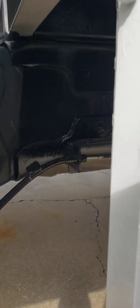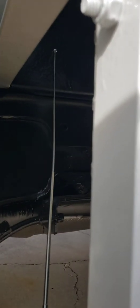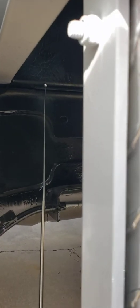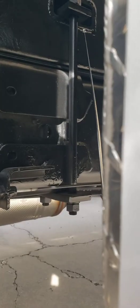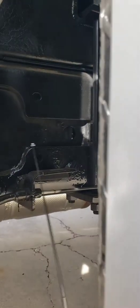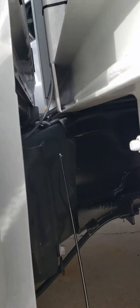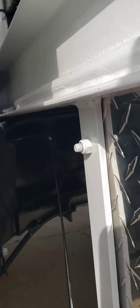It's a little tight, but you can see the area of fitment here. Now you'll notice that our main stringer is tubing — it is a rectangle tube, a two-by-eight heavy-duty tube — and you can see we encapsulated the frame through a cut-through here. This brings all your stress that would normally be associated here towards the rear of the truck back into a more solid area.